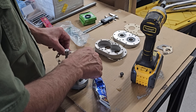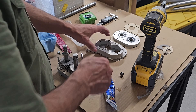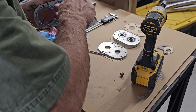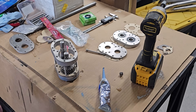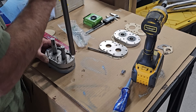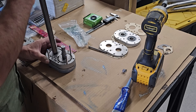We'll just keep that process going along — gasket, plate, gasket, plate. I've selected a few different thicknesses of metal to have the waterjet cutter make this in as few parts as possible. You probably could have created this with a three-piece casting, but in the end using waterjet and just plate sheet material, it's taken five parts, five layers to do this.